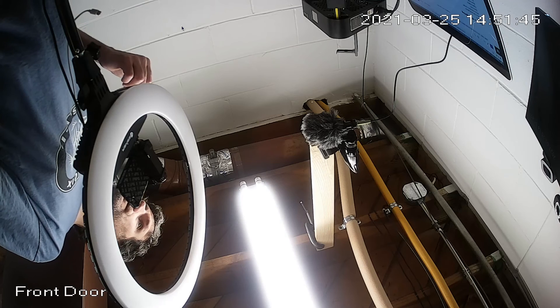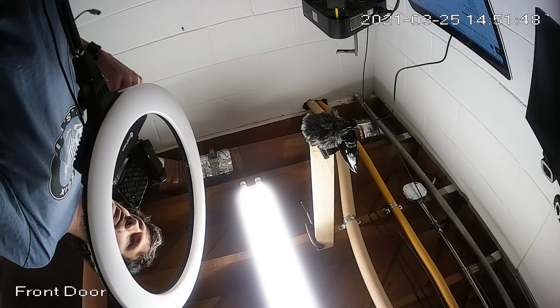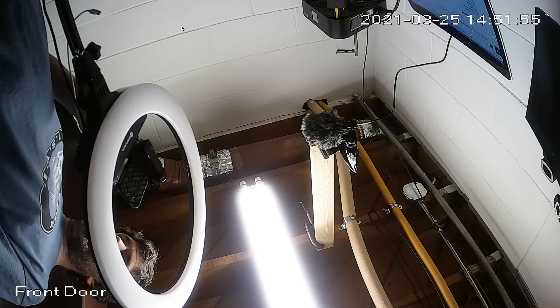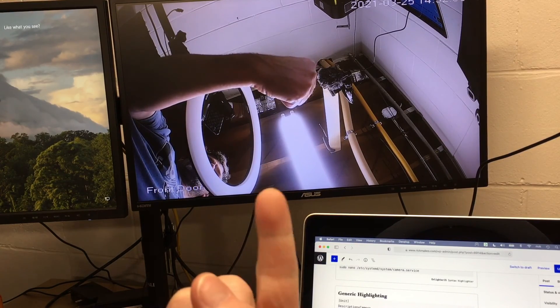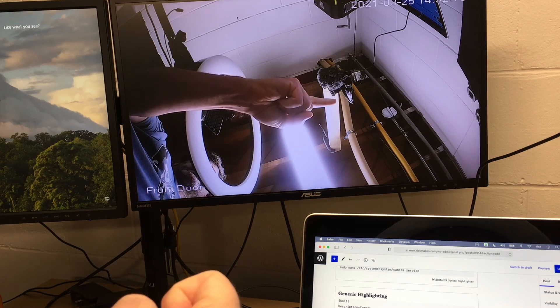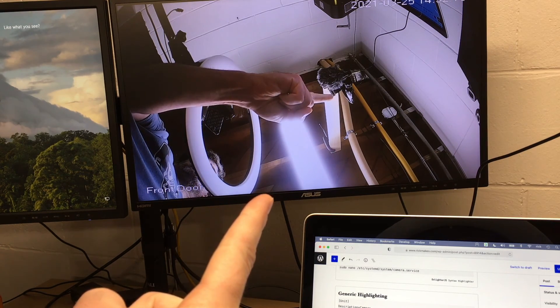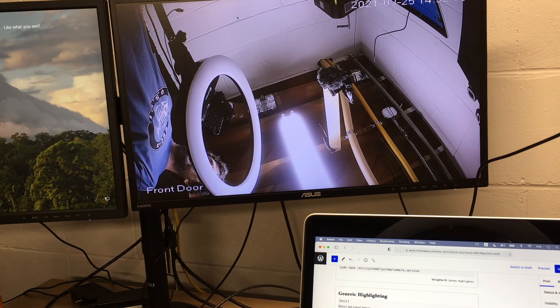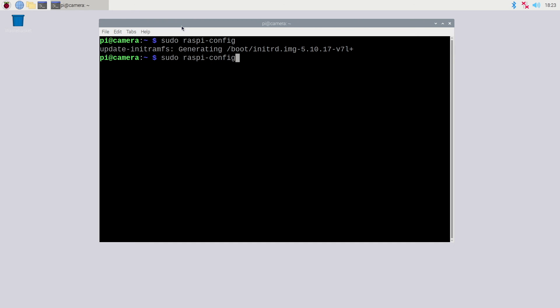After the reboot that took a little bit of time because the camera has to boot up, get an IP address assigned, and connect. The camera is now showing automatically. I'll test the latency — I'll put my finger up and you can see it appear on the camera feed. I've measured this to be about 1.6 seconds, just under two seconds. If I want to get back to the Raspberry Pi I just unplug the camera. To tweak anything you need to turn off the overlay file system first via raspi-config under Performance Options.